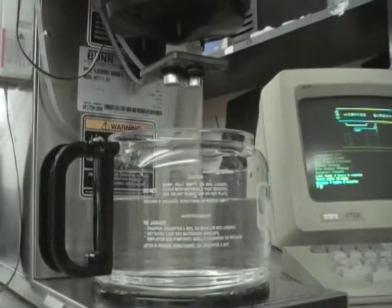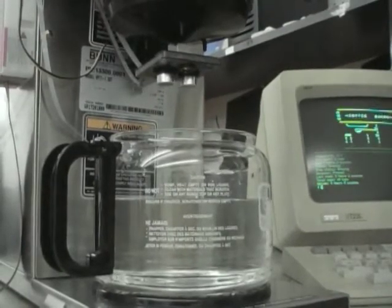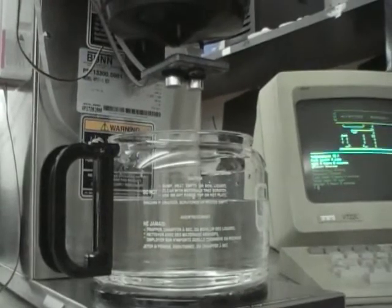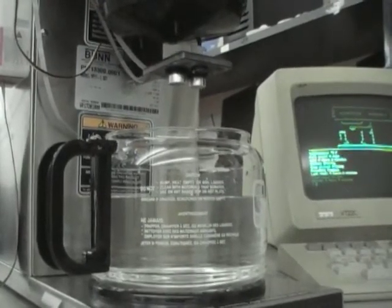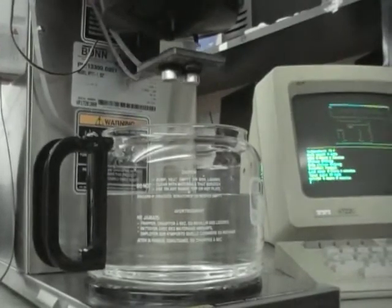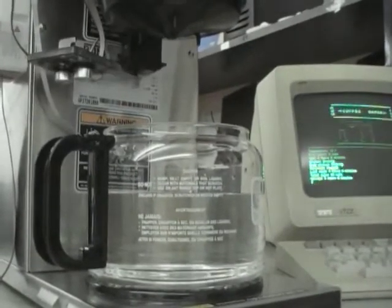After the brewing process is completed, it waits a designated amount of time before swinging out the arm to reread the water level, just to ensure that no water gets on the read head, and that in case any cups of coffee were taken from the pot in the meantime, we'll actually know the fill level after the dispense.